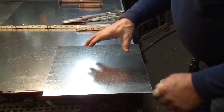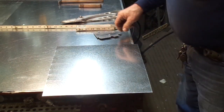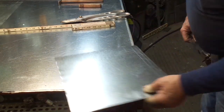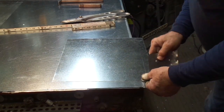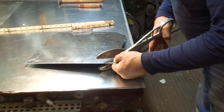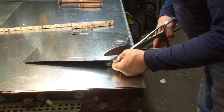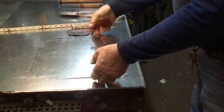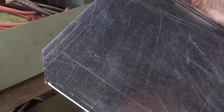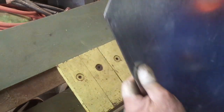I've got one more thing to do and that's to make an end cap for the supply trunk. If you want to see that, I'll do that real quick. We've pretty much got this little project fabricated. To make an end cap, you take the dimension of your duct — this particular one is 10 and three quarter by 12. Add two all the way around, so it's going to be 12 and three quarter by 14. There's 12 and three quarter, there's 14. Take your homemade handy scribe and go on the drive end — mark it so you know which one it is. The S end just gets a straight mark. Drive end. You don't have to put that second mark on there but I like to. Come right across and take just a little bit of that center out — not much, just a little bit — so when you fold it up to 90s in the brake it won't interfere. Now I'm going to take this over to the cleat bender and fold the drive tabs, then come back to the 8-foot brake. We've got drive cleats on the long dimension on this particular one because this duct is the long way vertical instead of long way horizontal.